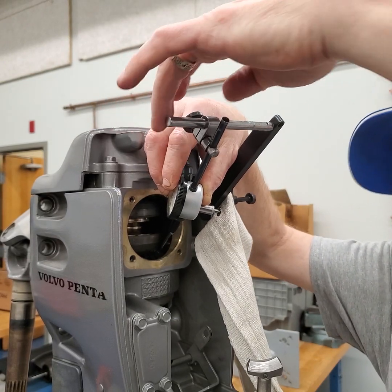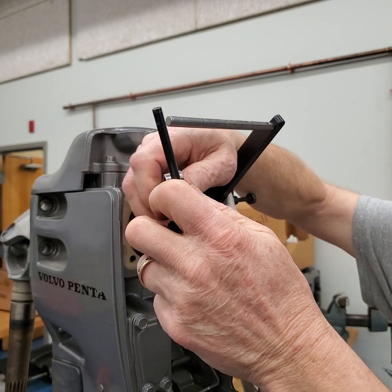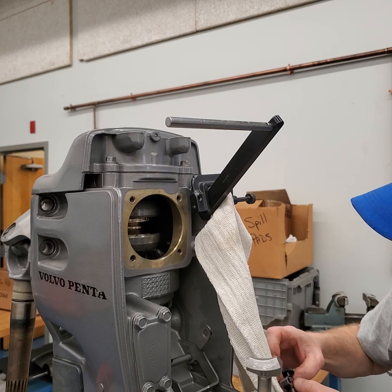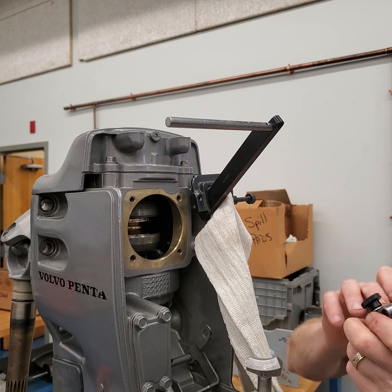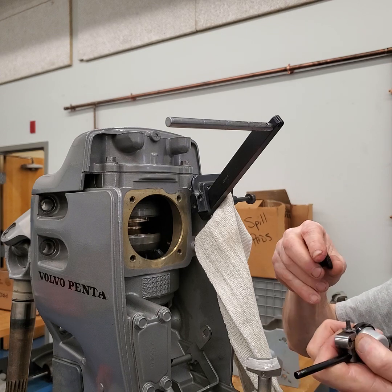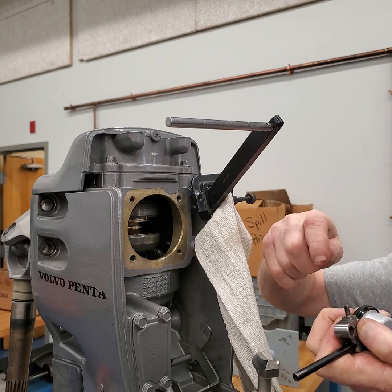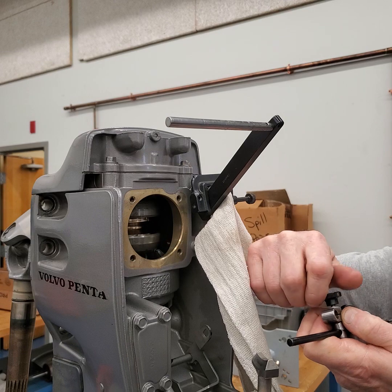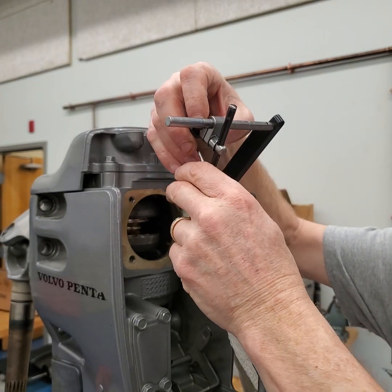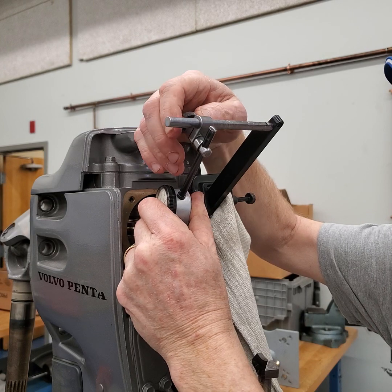The washer fell off — there's a key slot in this for the washer and if it's not lined up right you can't tighten it up. Once you get the washer lined up, the washer is actually keyed onto this. Once it's square to that, then you tighten it down — it takes a little finesse. Let's try this again: halfway up the gear teeth and I want to be 90 degrees towards the gear.